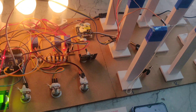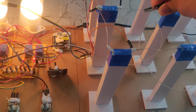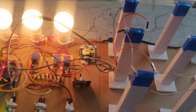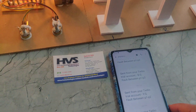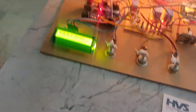After that, remove this fault and reset again — then only the system will work from the start. Now we make another phase fault. This is the Y phase. Now we are connecting this one between P1 and P2. We can see 'Y ground' and here we can see the message: 'Y ground'. Now again for the R phase fault — this is the B phase and that is the R phase. We can see from Twilio: 'RG between pole 1 and pole 2'. Again reset.